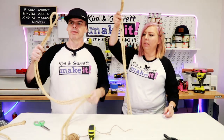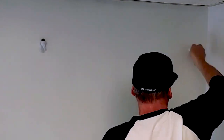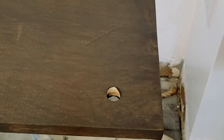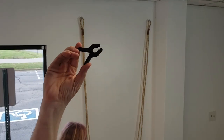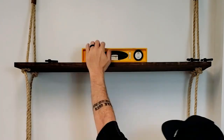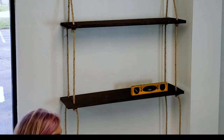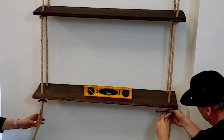Now let's go to the front room and install our shelves. I'm going to use that same five-eighths-inch paddle bit to make a hole in the wall, because we're using a hook that has an anchor bolt. Then we just toss the loop over top of the hook. Next, we'll add the rope into our shelf holes — this will be our top shelf. We'll slide it up, use mini clamps to hold it while we tie it, tie a knot under each side, and ensure the shelf is level. We're going to measure 18 inches down for the second shelf, and the next shelves are all 18 inches apart.